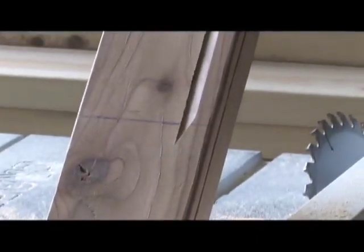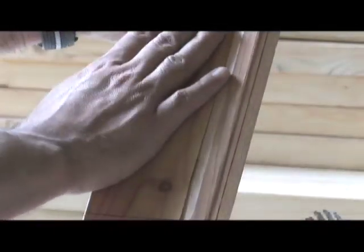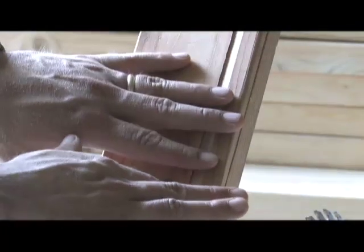As long as you stay tight to the guide, you're not gonna have any problems. It's important to remember when you do this that you want the blade to come just short of this. You don't want to cut into this, because this squeezes together and becomes too short, so that's going to throw your second cut off. This right here is what pushes against your stock. This section right here pushes against your guide, and it keeps your blade perfect on each side.